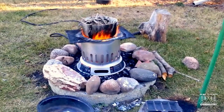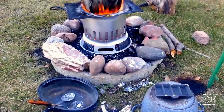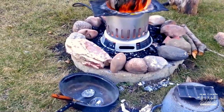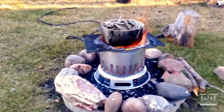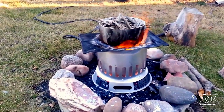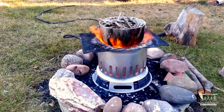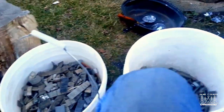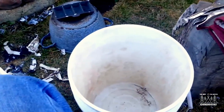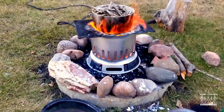So this is how we start off. I've got my ingot plate there, a spoon for skimming and a scooper. I've got my 80,000 BTU propane unit there on a barbecue grate, and a little bucket and wheel weights. I'm sorting wheel weights from the stick-on weights while I wait for the pot to boil.